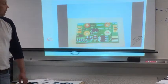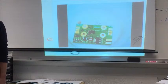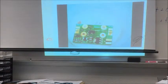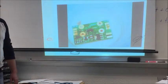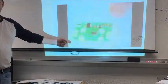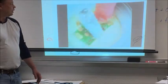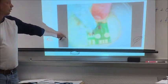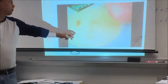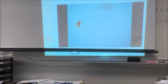It's done. They're soldered. So, as I told you several times, it has to be cleaned. And this board really needed cleaning. I actually spilled a lot of flux. There was a lot of resin on the board. I had to clean it. I just use, this is plastic cup from yogurts with cereals. So nothing special. Isopropyl alcohol. Properly, you should use anti-static brush. I'm just using toothbrush. That's it.